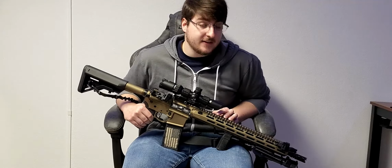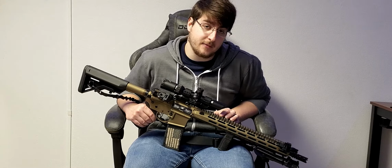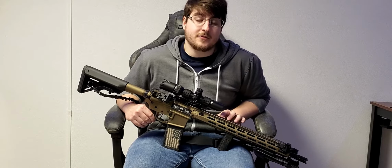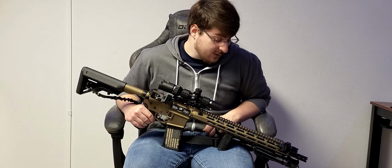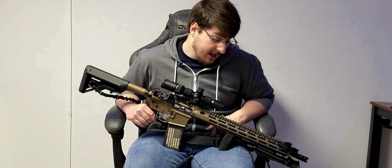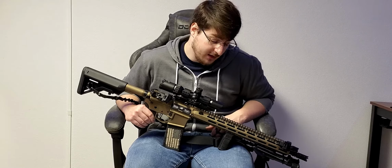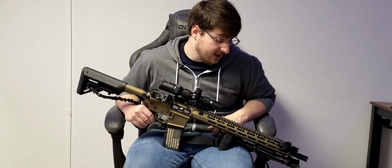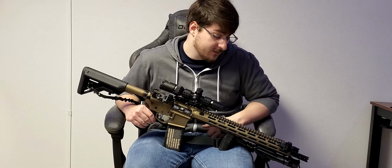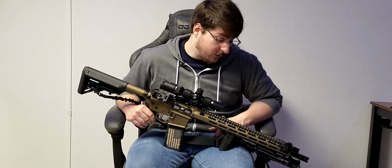The way I did it is not the way that they recommend doing it. They want you to use an actual legitimate spray gun hooked up to an air compressor, and they want you to sandblast everything, and they want you to bake it in the oven before you paint it. Obviously I didn't do any of those. I just took a Scotch-Brite pad, roughed everything up, and some sandpaper or two, and then I cleaned everything, and degreasing is the most important part. You want to make sure everything's degreased, because if you don't get all the grease and oil out of your parts and then you paint it and then all that oil comes back out, it's going to ruin your paint job.